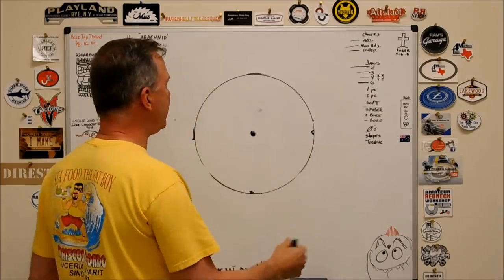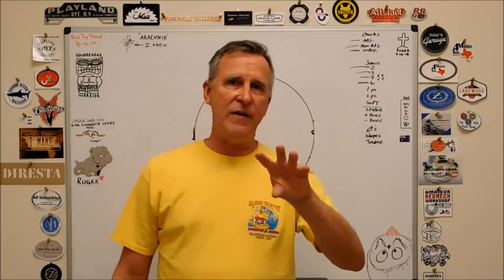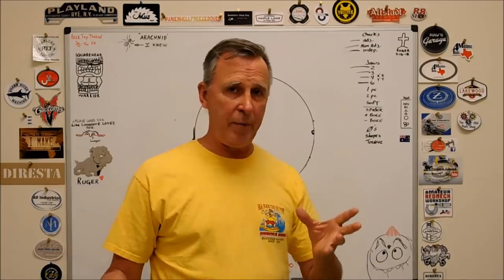All right, boring the jaws. The benefit behind boring the jaws is you have fantastic contact on the outside of your part. You're not going to leave teeth marks in it. You're going to support it better.